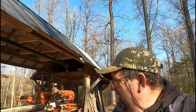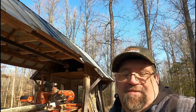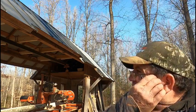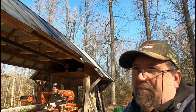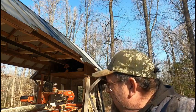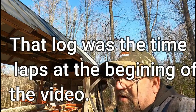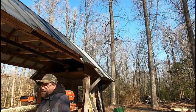Alright, I'm back. We just did a live and I just walked all the way back — a little tuckered out. We'll try a different view, just for a little fun. I got you guys on the front of the tractor and I'm going to bring you up in the air and tilt you down to get a higher view looking down on the mill. I started cutting that one with the crotch log — it had the triple in it. I got one board off the top, then a second board that pretty much got down to the flat spot and got rid of the triple — the branch coming up. So now we're down to a double, or a double combination with a triple crotch. Let me lift you up and get you in position, and we'll go ahead and cut the rest of this log, then put one of the smaller logs on the mill and cut that one up.